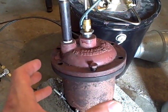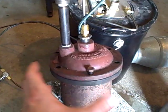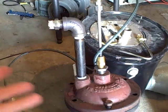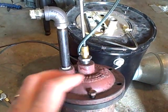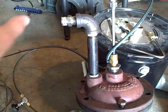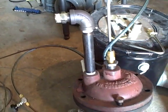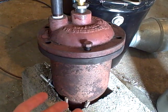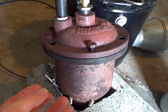But if we kept the air on a high setting, it would basically just move the combustion inside the pot. Inside the gasifier assembly, we could actually hear it burning, and we could see bluish-colored smoke, which indicates combustion. But then if we turned the air back down, the combustion would stop. We'd get a gray smoke coming out, which was very flammable — we could get a nice flame lit at the end of this pipe. But that flame would die down very quickly because without all the air going in, we weren't supporting enough combustion to produce enough driving heat to keep the pyrolysis action going.